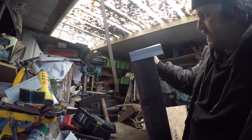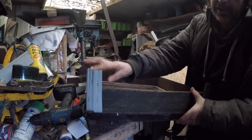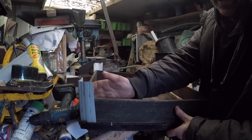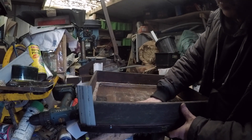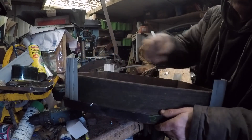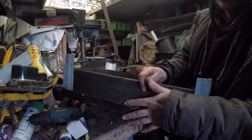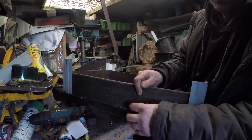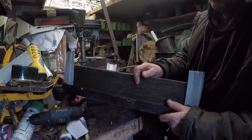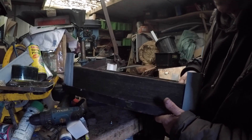That's one done — then repeat that on all four corners and put the lid back on and we're basically done. The completed lid looks a bit odd having these things extending down, but in my experience they will keep the water out. I've never taken one of these lids with box joints and found it dry — they almost always leak. I've also kept a big gap here so there's no chance of capillary action. Any rain that gets in, when the next dry windy day comes it will dry out, so you try and have as much drying ability as possible by leaving gaps.